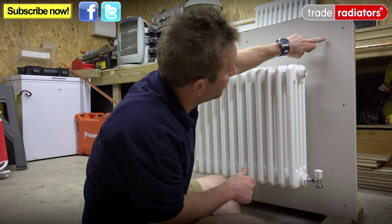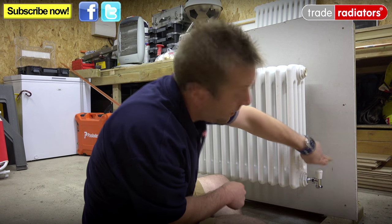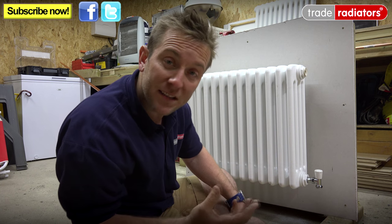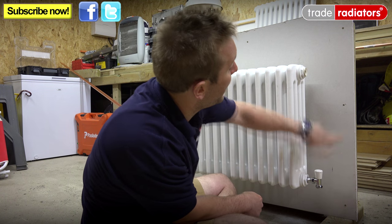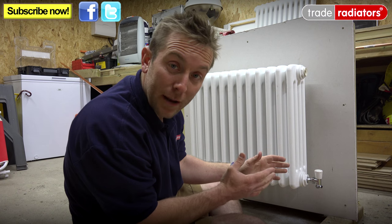So now we know exactly where we're going to drill our clips and what line we want to be on. I'm just going to move this line up a little bit because in a minute I'm probably going to be soldering around there, and I don't want any plastic clips near to where I'm soldering because obviously they'll melt. So I'm just going to drill my pilot hole there and there, then I'm going to get my two plasterboard fittings in there and get those two clips on.